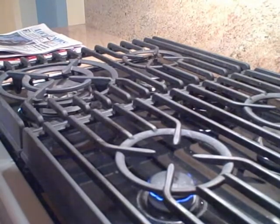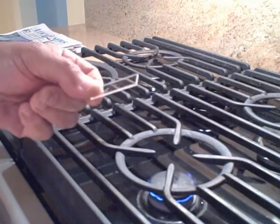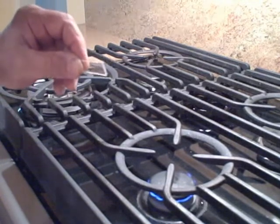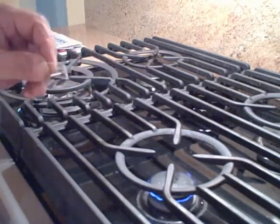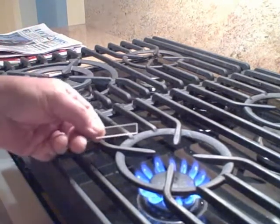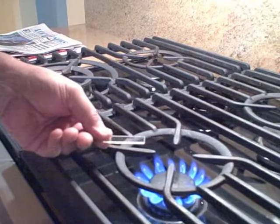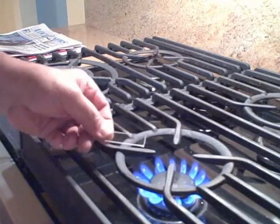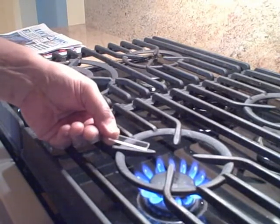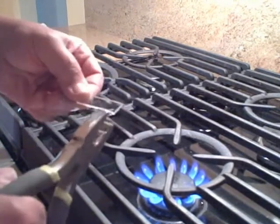Using the bandsaw I've cut a 1-1/2 by 2 inch piece of plastic out of the plastic sheet. I'm going to heat this and bend it so I can form an L-bracket. That L-bracket will be placed on the volume pedal and used to hold the rack. This is just a standard gas range — I'm just going to heat it and watch. As it gets very hot you'll notice that the edges start to fold over. It only takes about that long.